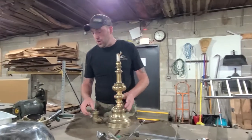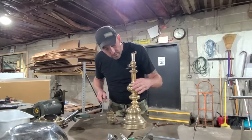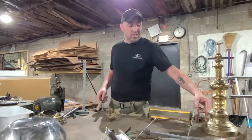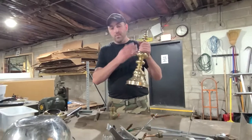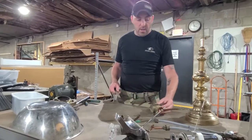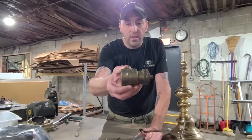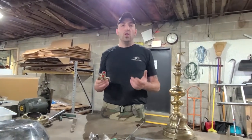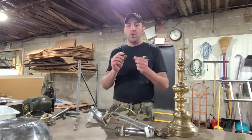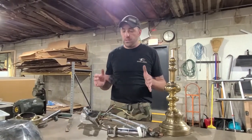Now when I put a file on this piece — it looks brass in color on the outside, silver on the inside — more likely going to be die cast. But here, if you grind on a fitting, that's the good stuff right there. That's brass. If it's internal, a lot of times it's going to be brass. Those go right in my brass buckets as-is. A lot of times brass can have a little plastic, grommets, or even a little steel on it — doesn't matter. Brass is so heavy that percentage-wise it's still going to be greater than 97% brass by weight.